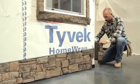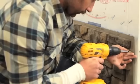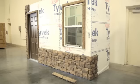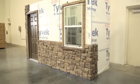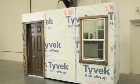Before the last panel is installed, remove the loosely tacked corner piece so the last panel can be properly secured on the right side. Then properly fasten the corner. Proceed up the wall in the same manner to ensure a proper stagger and natural appearance.